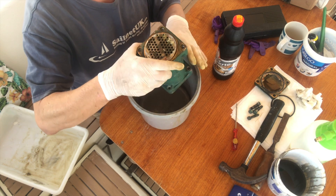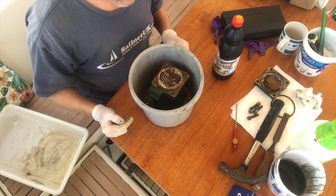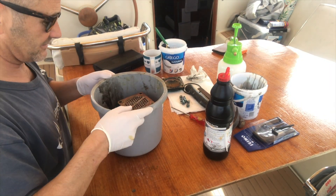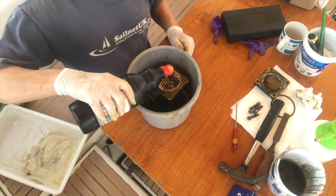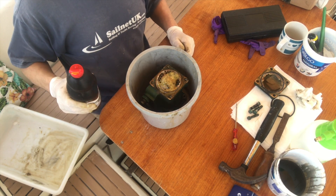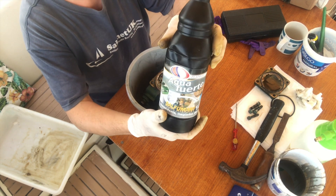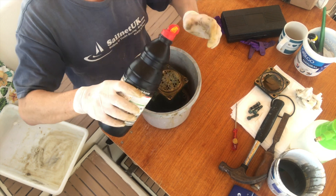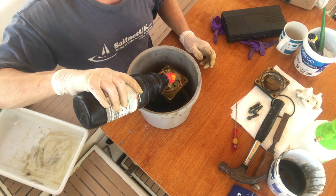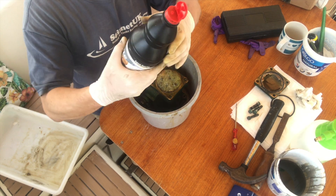There's about 10% of these tubes blocked, so I'm going to give it a washout with Aquafurta from both ends and give it a poke through to clear the blocked ones. In the absence of safety goggles I've got some fancy sunglasses. This is Aquafurta — it's about 20% hydrochloric acid. It's a Spanish brand; basically it's just brick cleaner. Get it at any DIY shop and that bottle just cost 1 euro.